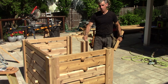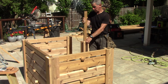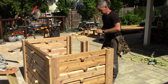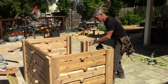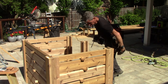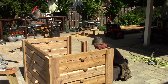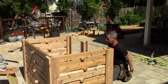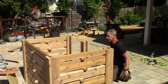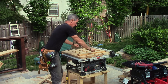Stave, stave, four-inch stile. I've got a two-inch deck board I'm going to fit in between, like so, to separate this panel from this panel. Building a cedar compost bin — I like building this kind of stuff, by the way. It really is fun. The table saw makes a pretty good work table for assembling our first panel.